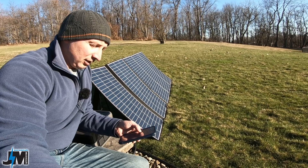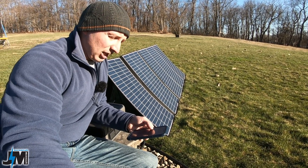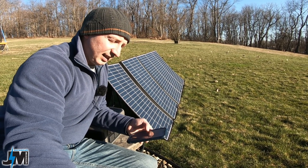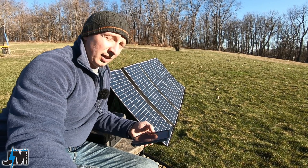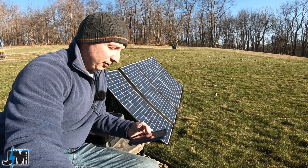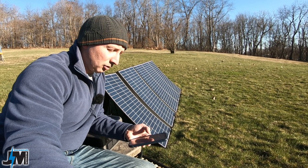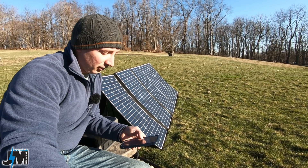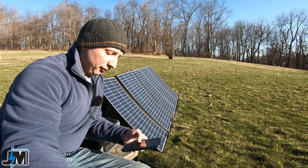Part of it was because it was a nine hour test. With no load on this unit, you do have about 11% loss every three hours just with the AC outlets being on — the parasitic drain on the AC inverter when it is turned on is about 11% every three hours. So I lost 33% in those nine hours just from the AC inverter being turned on, which is probably part of the reason why I only got 150 watt hours from it that time.